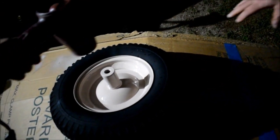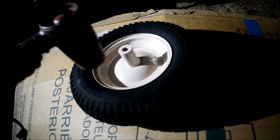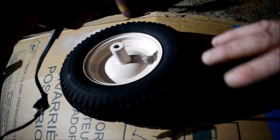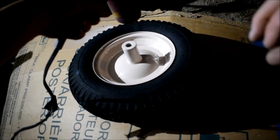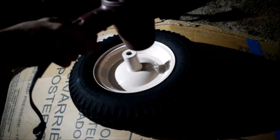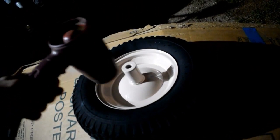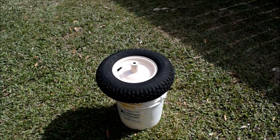So what's the point of that? The point of taking the tape off before it's dry is so that you don't take the tape off and rip a paint line and start your paint ripping midway through the drying process, or leave what's called a rough edge on the paint job. Like a paint line that's real rough, the paint's still relatively soft, so it will feather itself in. Got it. It'll level itself. Right. And that's the idea of taking tape off before paint is dry.